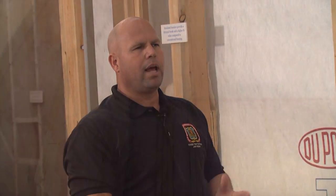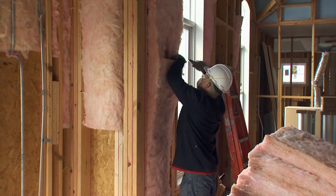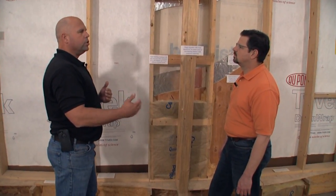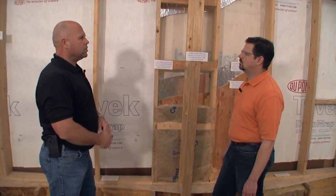Doing this allows us to have a wider wall cavity. Wider wall cavities mean more insulation rather than a lot of wood or metal in our walls. It's going to reduce the amount of thermal bridging that might occur. Thermal bridging is basically the cold air on the exterior — or hot — warming up our stud or cooling it down and then transferring that hot or cold into the building. The amount of wood we've reduced reduces the amount of thermal bridging that might come into the building.